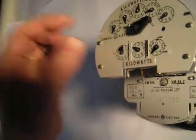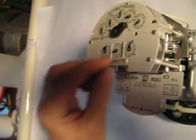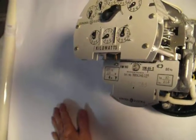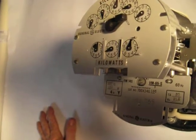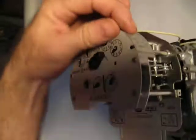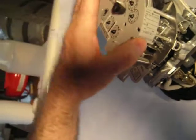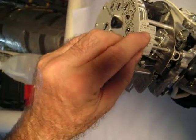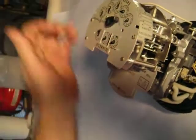The demand reads the peak power — kilowatt hours is the integrated energy (power times time), while kilowatts is instantaneous power. The meter integrates over a 30-minute period. There's a heater or thermal element that low-passes the signal, so if a motor starter kicks on and draws a lot of power for the first few seconds, this demand pointer won't move much. But once it's been on for a 30-minute period, it averages up to what they've got to size the transformers for. This is called the M60 register with a 30-minute demand interval, and you can change it to 15 minutes or an hour.